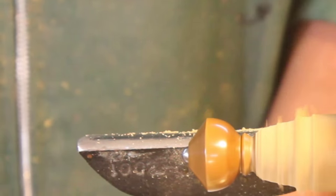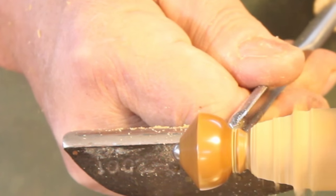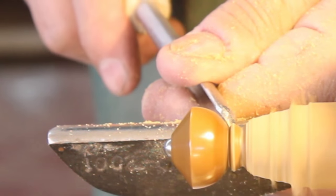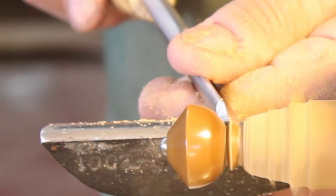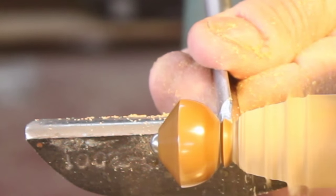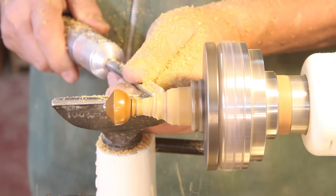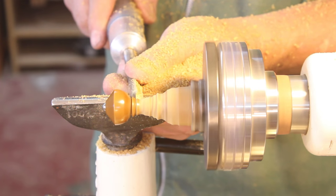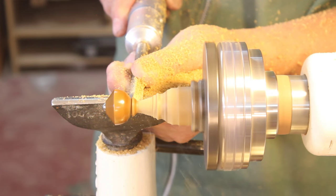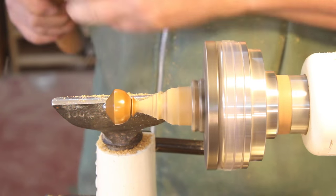So I'm really creating a little bit of a valley in there — a V-cut. I've got a detail spindle gouge that I'll use right now. I'll turn that over and work on the other side, then reduce that down quite a bit since it's still too large in diameter. Going back to my spindle gouge and taking a little more off that handle — it's important to maintain a little bit of that mass to the right to prevent any kind of vibration.